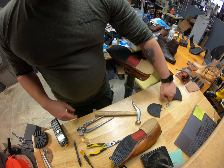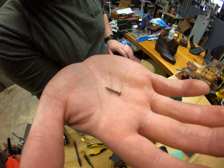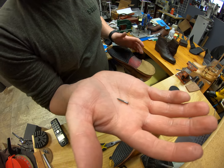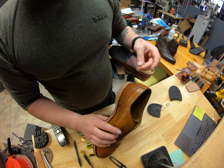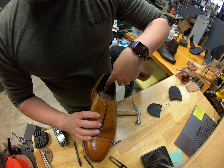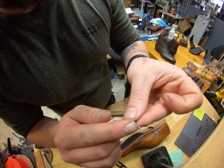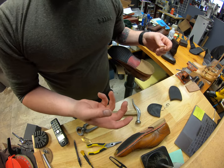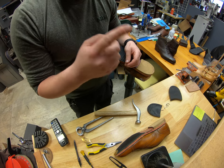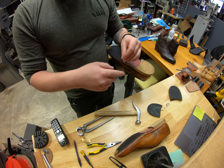But continuing on, we've got these 5/8 inch threaded nails, and that's usually what Allen Edmonds uses as well. A lot of other shoe factories also use that. These particular nails are used for when being nailed in from the inside or the outside, because they have these little rings across them, little round circles, almost like a screw has, screw swirls basically, where these are just straight rings.